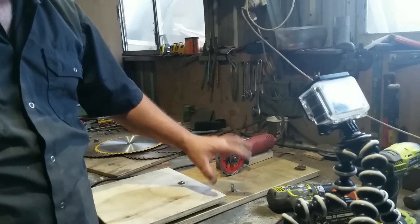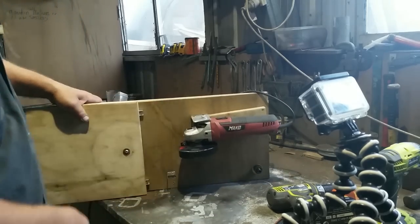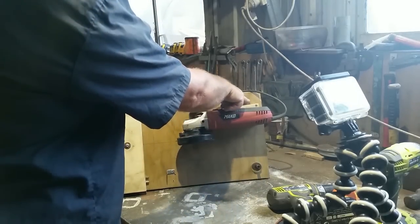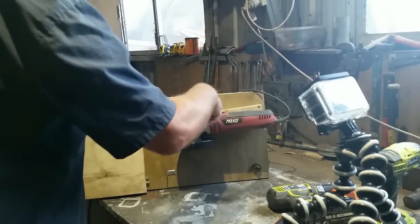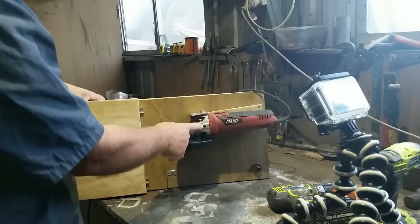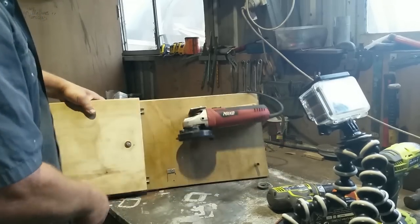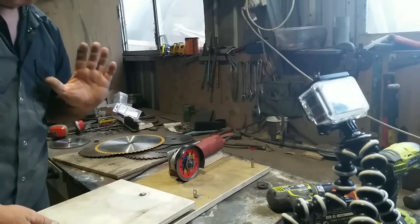And you can have any kind of locking device you like here. I've just gone for plain and simple. You'll also need a locking device to lock the pivoting of the angle grinder and I've just gone for a screw. The further out here that you move, the further away from each other your holes will be. So because I've made a long piece of wood here, that's working well. This particular grinder has side handle threads on the top and both sides, so I've been able to bolt it from underneath and from here to secure it so that the grinder is very firm on its base. And really, that's all there is to it.